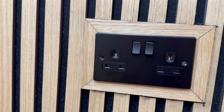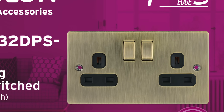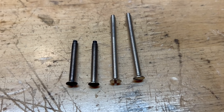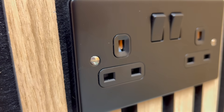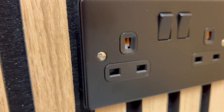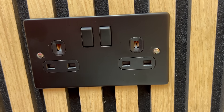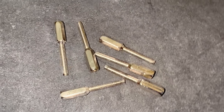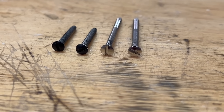There are a couple more problems you might need to solve. If you're using a decorative socket with visible screws — like these Niglon Premium Edge — and you're bringing the accessory forward, you may find the original screws are too short to reach the back box. And if you're tempted to just grab whatever longer screws you've got in the van, beware: you might end up with mismatched chrome screws on a sleek black or bronze faceplate. That's another crime scene right there. The fix? Use screw extenders — they thread into the existing back box and let you reuse the matching screws supplied with the accessory, keeping the finish consistent and professional.